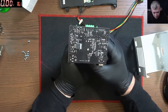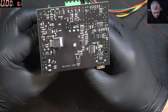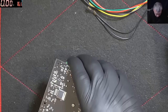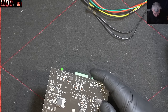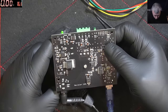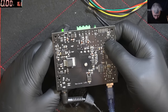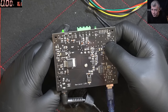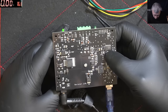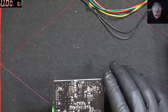Oh, this has some nice electronics here. So where do you think the problem is on this board? The board is not speaking with my computer. Lol, something is hot here. Okay, let's plug in the charger. Let's plug in the USB cable. And no, still nothing on the computer. And this chip is getting mad hot. No, this one. So this chip is getting hot.